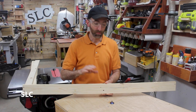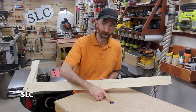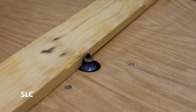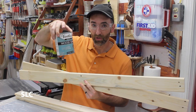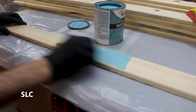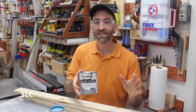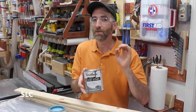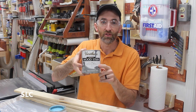Since we're going to be sitting on these planks, I don't want these sharp edges to poke into anybody, so we're going to take it over to my router table and we're going to just round over each of the edges. Next up, we're going to be staining the seat in aqua blue. After staining some of the boards, we realized that having a solid blue seat would just be a little overwhelming to the eyes, so we're actually going to alternate the colors with some weathered gray.